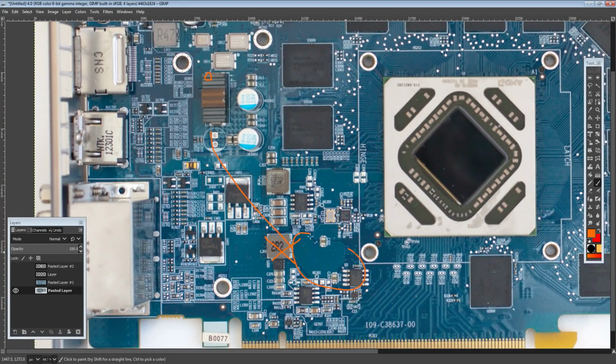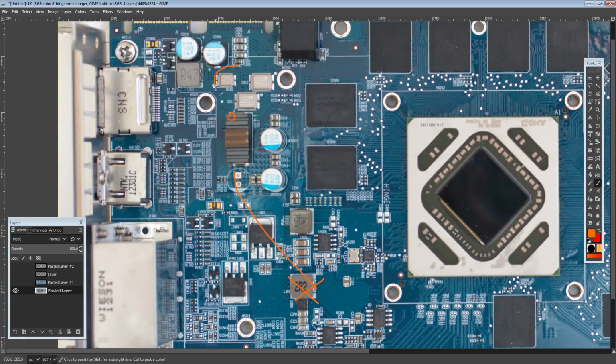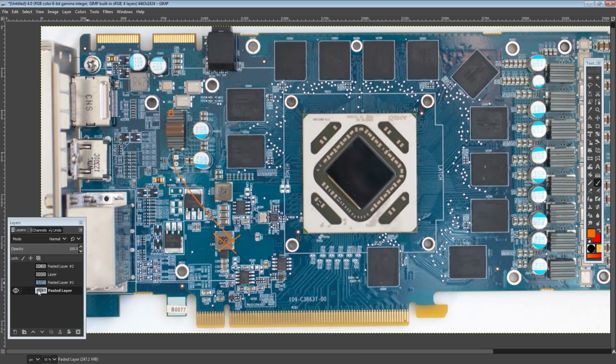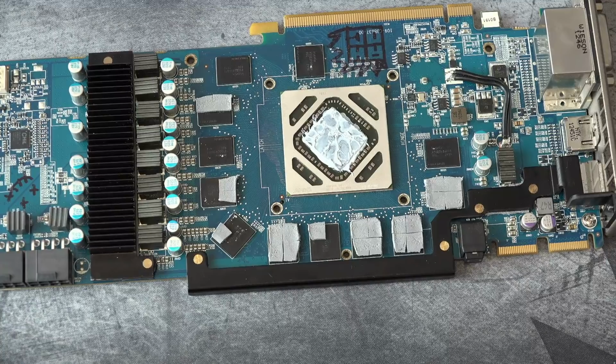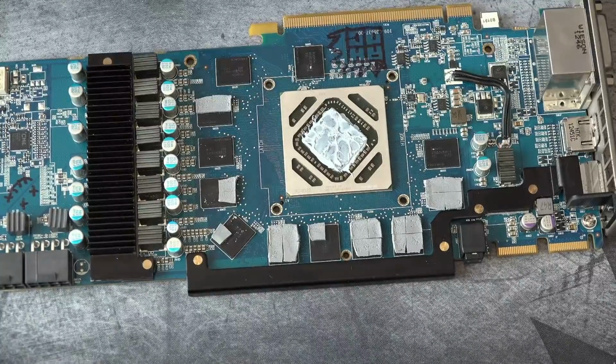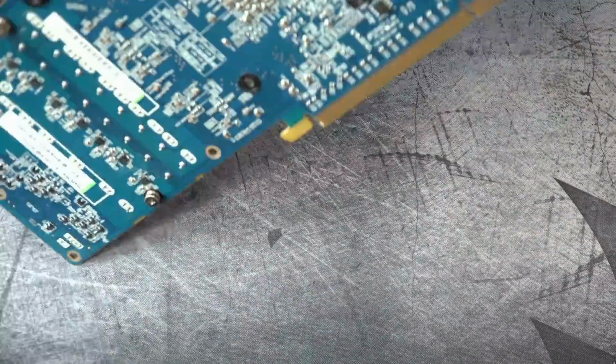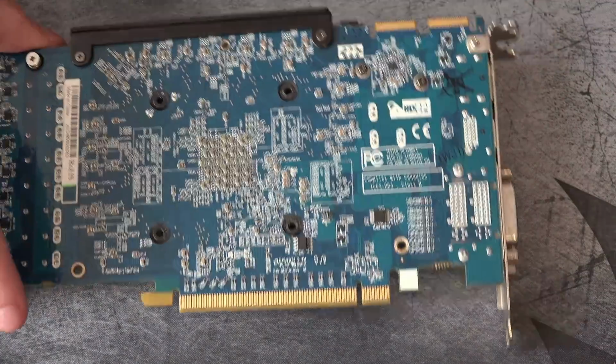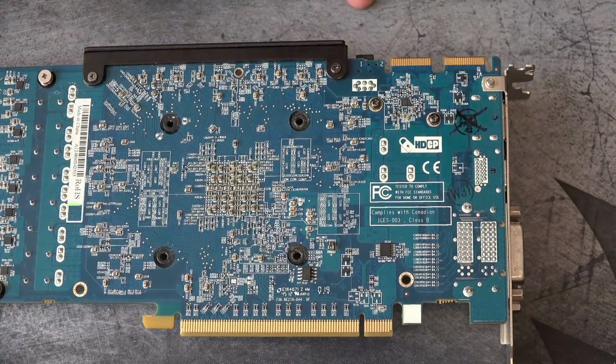Because, yeah, I'm not too concerned, but this is definitely one of the least correct ways to repair something quite possibly ever, right? It's just like, oh, the VRM is tripping over current protection because you're trying to power more stuff with it than you're supposed to be powering with it. Oh, I don't know. We're just gonna grab a resistor off of some random dead card and use that to fix it.